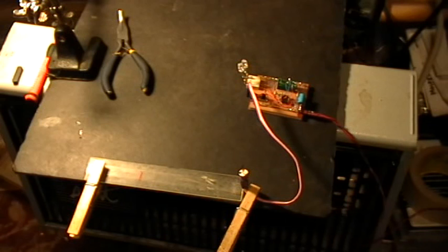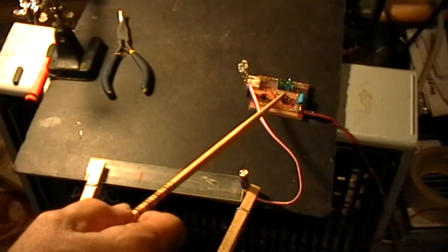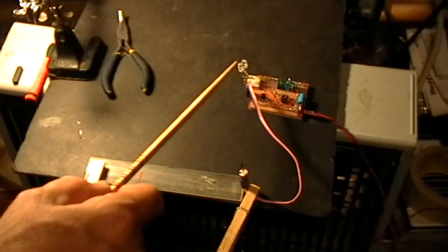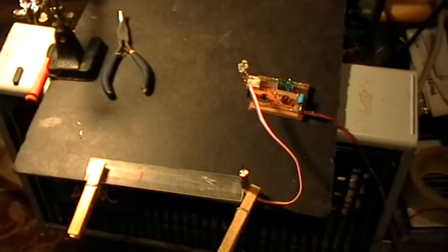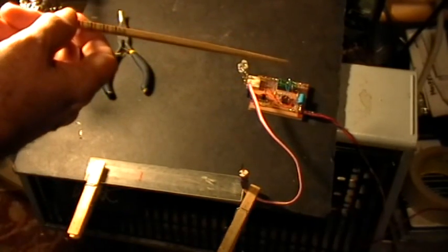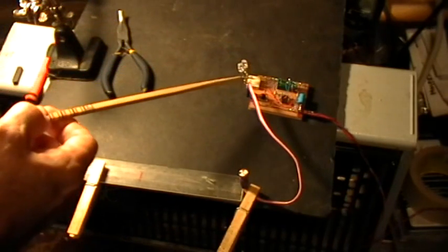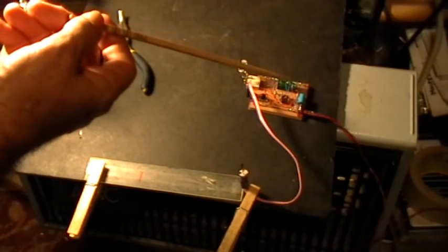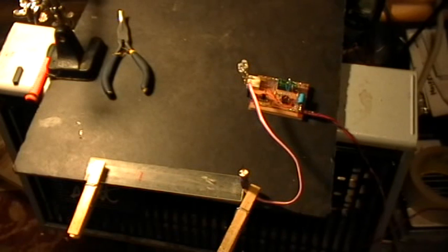Good afternoon, welcome to my laboratory. This is a supplement. I've been playing around with the Hall Effect Sensor Op-Amp switcher pulser, and I've got the sensitivity adjusted. I had some stability issues which I cured by putting some more capacitors in there. I put a tiny little ceramic capacitor across from the input — that is the output of the Hall Sensor — to ground right at the Op-Amp chip, and I put a 47 microfarad capacitor across the power supply leads, and those have cured my stability issues.